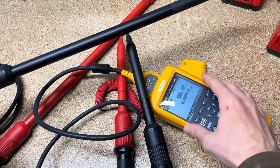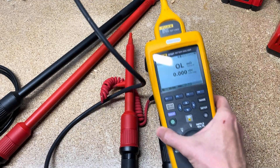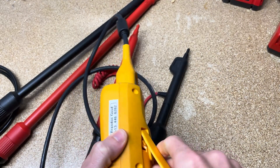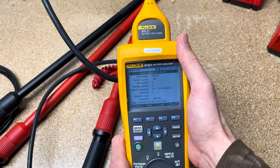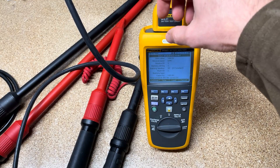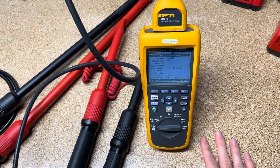We're seeing more and more people use the Fluke battery testers. Fluke is known for its ruggedness with multimeters, and the nice thing is this is a small portable version that has the ability to do all the tests people are wanting. As you complete the test, it does have software to track your batteries over time. One really valuable area for this battery tester is hospital and healthcare, because NFPA 110 and the Joint Commission require that all backup generator starter batteries be tested monthly with a tool just like this. So this can be your solution to help you stay in compliance in the healthcare industry.